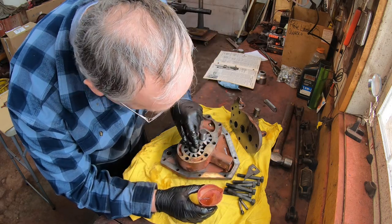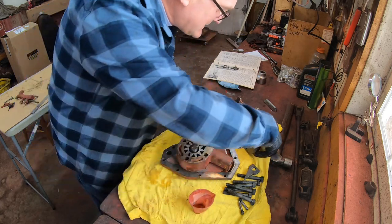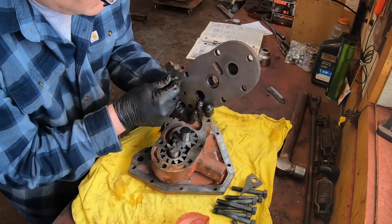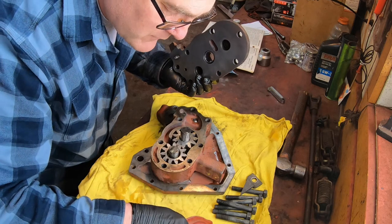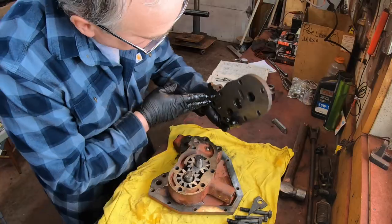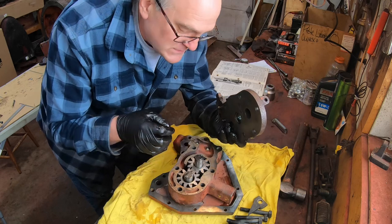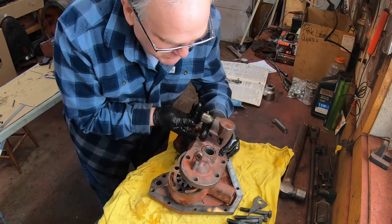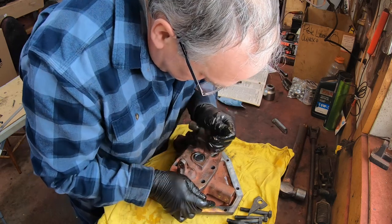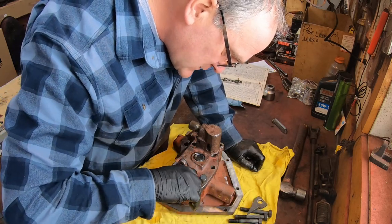I hope all this explanation hasn't slowed things down too much. The last thing to remember to put in are these little pistons that work against these check valves — they're part of the operation assembly. Just oil them up and put them in the bores, lined up one on top of each ball. They act against that ball when the pump operation says to drop the cylinders and release pressure. This just fits together on here, and you've got to make sure you get the shafts lined up. There are a bunch of bolts to hold it all together — remember, no gaskets, no sealant; it relies on the machined surfaces to make a tight enough seal.